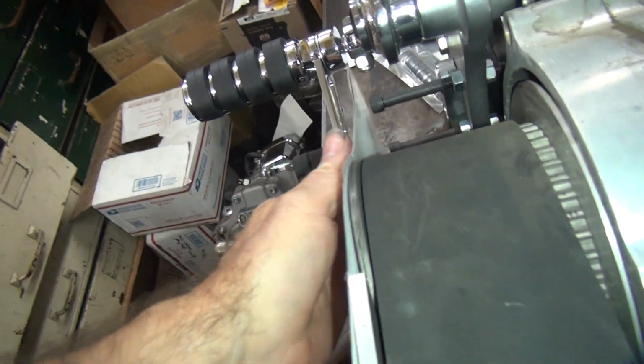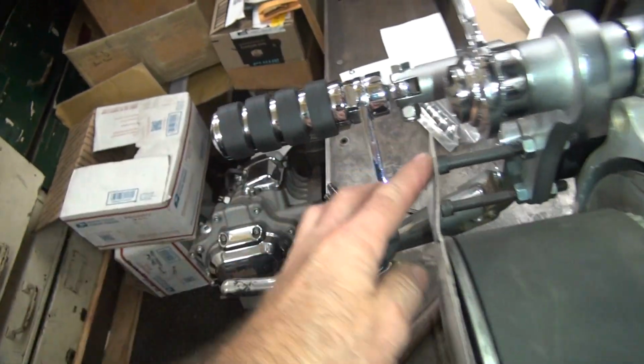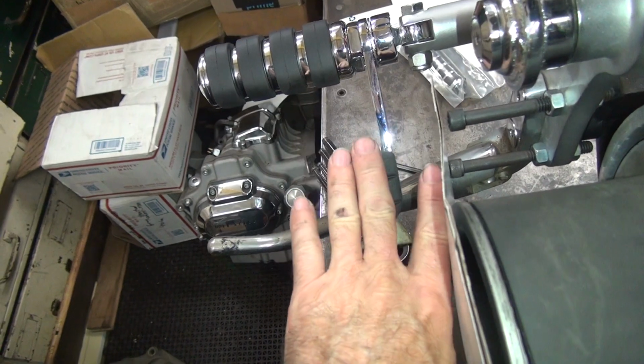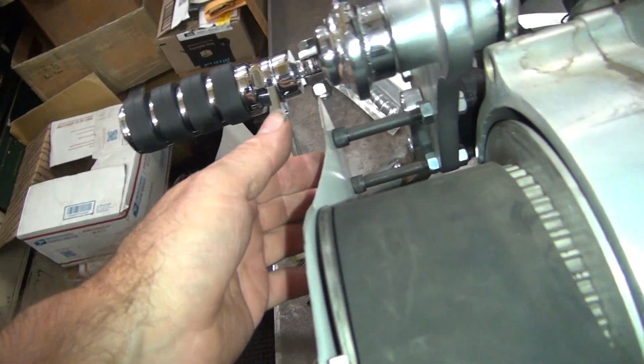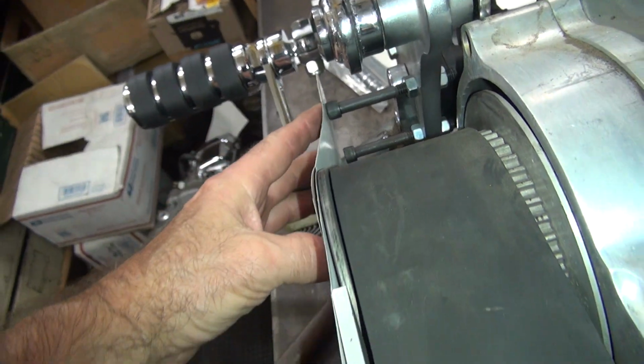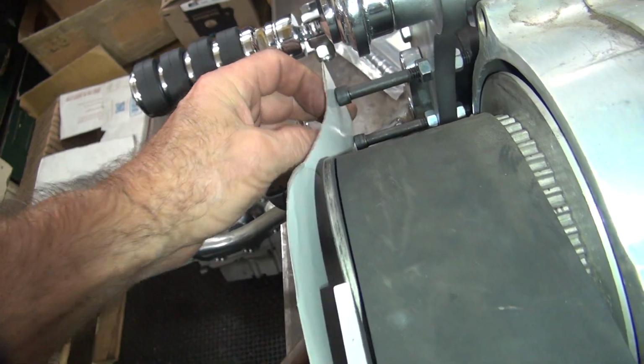So we're going to have our standoff sticking out like that a little bit. We'll bend this to a light curve like that, which gives you a lot of room for your foot right in here, your heel. So your foot doesn't have to be way out here. It can actually slide in a little bit. And we'll just bang, bang, bang on it right there. We have just a little bit of offset bend like this into it, nothing serious.